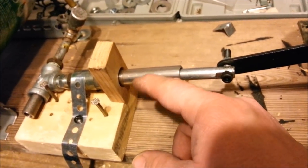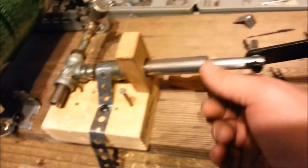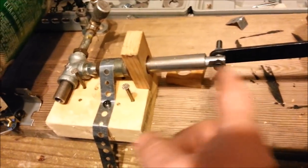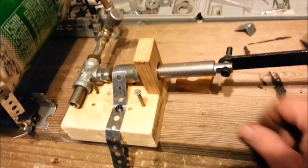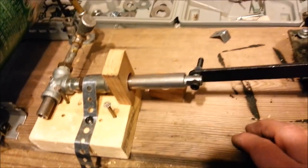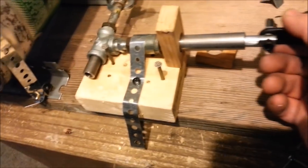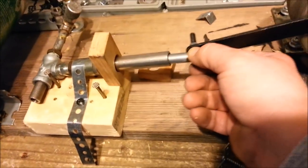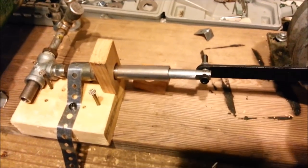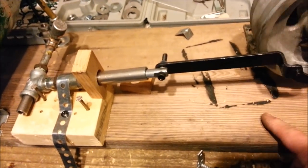Since it's a thread it allows enough air to come all the way through it. I'm going to use probably a little bit of grease because it's heavier than oil and it'll stay in there instead of just running out. It probably won't even need it but it'll help with the wear, because this thing won't last forever — you can hear the wear on it right there. I'll show you later in a test that it seals plenty good enough to work.